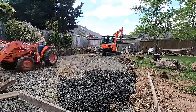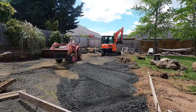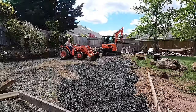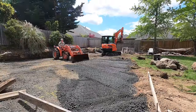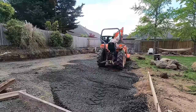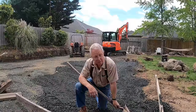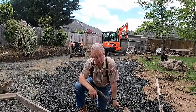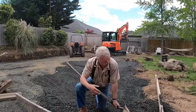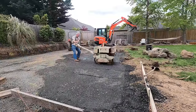I've got plenty of water in this — it's not evenly mixed, but I think close enough. The water migrates back and forth and will probably even out. Hopefully the compaction will be as well as it needs to be. Right in here is mostly under a sidewalk. The building will run across over there where that plumbing clean-out is that we're going to be able to use for the sanitary sewer in the bathroom — that's a real home run. I'm just going to finish grading this little bit and then beat it into submission with that little vibratory roller.